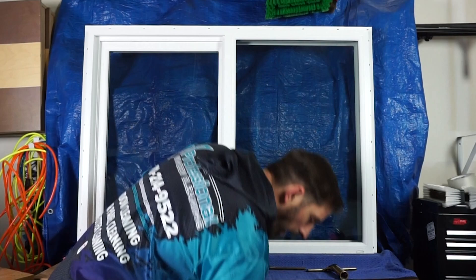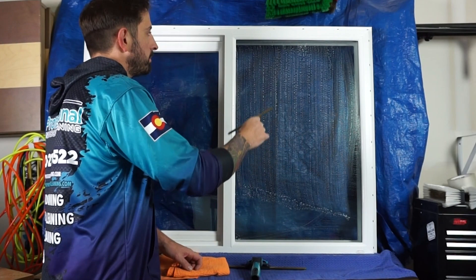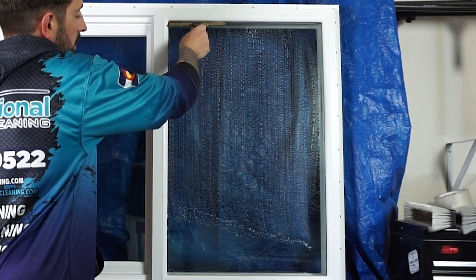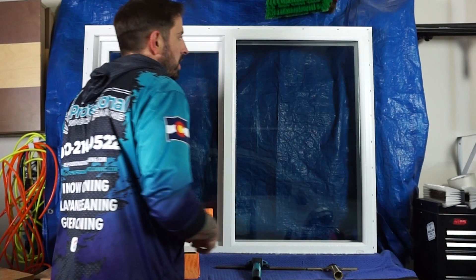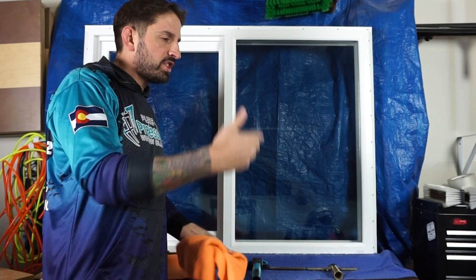Let me get into why we don't do three pulls on a window like this, especially looking at residential. Commercial is a little bit different, but for the sake of the video, let's keep to what I'm talking about. So when doing three straight pulls, one good idea is to detail your top edge so you don't have so much residual water when wiping your squeegee blade. If we do one pull, we got that. Now for the next pull, we feather a little bit, angle, and bring it down — and this almost covers it. But what happens here is you leave a possibility of streaks. I don't know if you can see it in the video, there's a cloud here, a line, there could be another line — you're bringing up the chances of having more streaks.